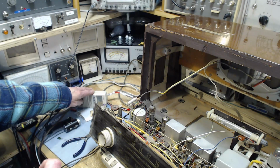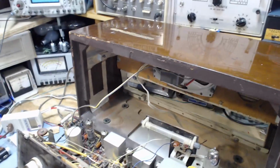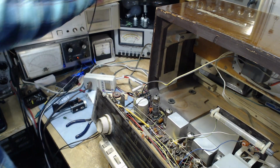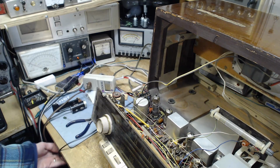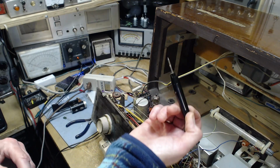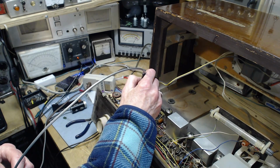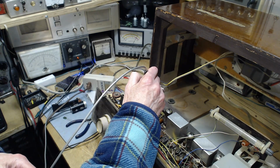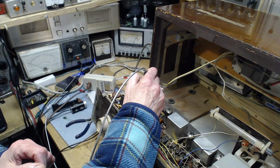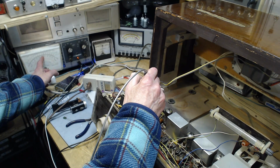Okay, we're running at 114. That's slightly below the voltage they call for. I'll try not to get my arm in front of the meter while I'm doing this. Who's got the high voltage? Where's my hand going? I'm going to steady it on this plastic cover here because this is painful. There's something. Okay, I'm on the 500 volt scale. It's 260 volts. Jumping around. Why? Because of me? Yeah, I think it's just, yeah. It's exactly on my meter.